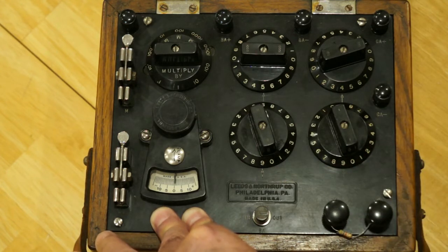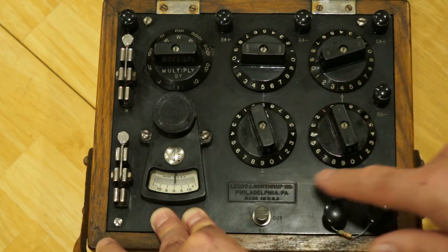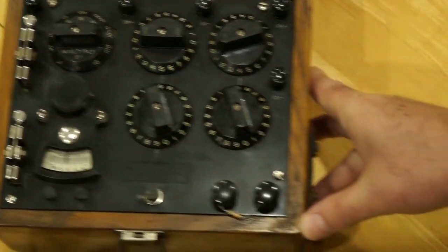The actual nominal value is 5,600. We're going to compare that to a digital meter reading. We have 5,499 from the Wheatstone bridge. I'll move this out of the way.